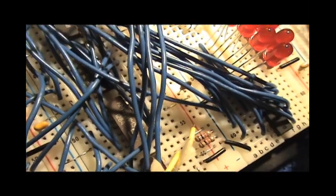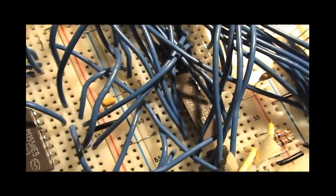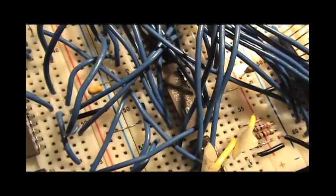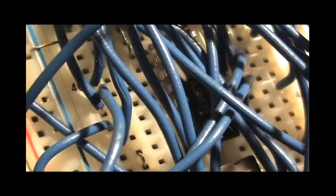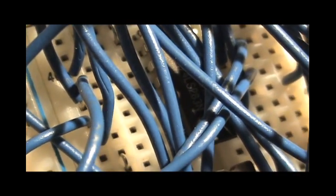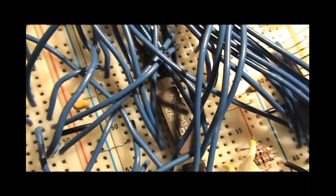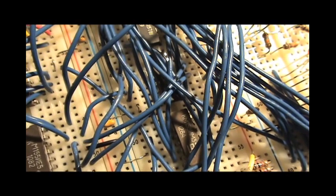The IM3 and the 74LS283. Now the IM3 is a clone of the 7483, which has basically the same function as the 74283 or LS283, except a different pinout. Of course, I could have used two of the same chips here, but I wanted to use as many of these Soviet chips as possible.